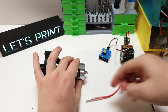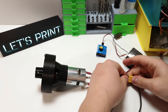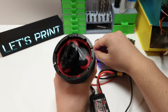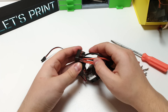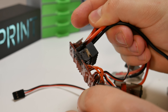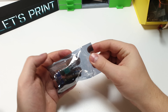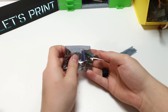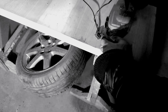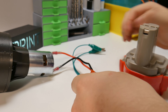Finally, the best part of the video — we can start with the first test. I have to mention that in this setup I am using one cheap Aliexpress ESC for the brushed DC motor. The first test was successful for the gearbox at least, but when I started changing the camera angle the ESC didn't survive — it started burning with open flame. So I switched to a DC motor speed controller, which I have pretty positive history with.